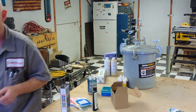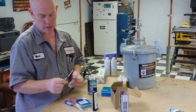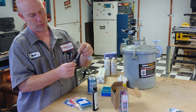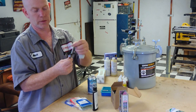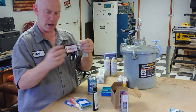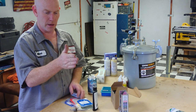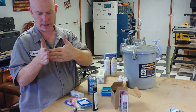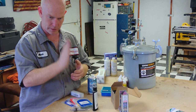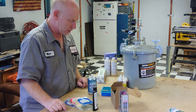I forgot to talk about barrel trimming. This barrel trimmer tool goes down inside the brass tube after you've glued it into your blank and removes all the epoxy resin from inside the brass tube. The other end grinds the end of the blank down flush with the brass tube, giving you a nice perfect perpendicular line from the brass tube to the end of the blank. That way when you put it in the lathe it fits nice and flush, and when you assemble the pen the parts all fit perfectly flush to that brass tube.